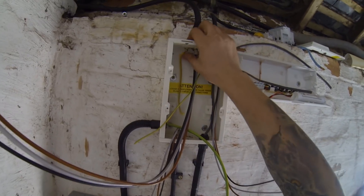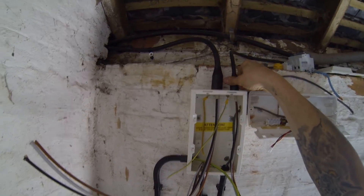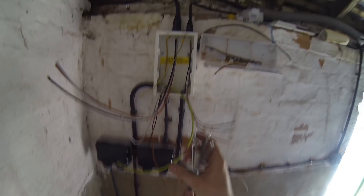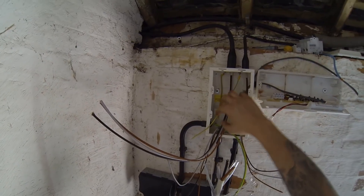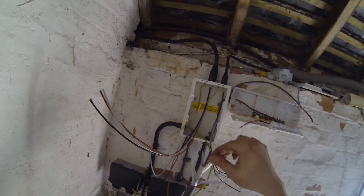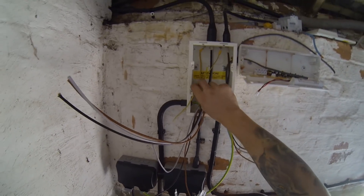I'll explain this to anyone that's not an electrician watching. These are called banjos, and they sit under your locking nut that is connected to your glanding kit at the top. Your armoured cable has your multi-core cables inside with another plastic sheath, then your metal armour spirals around the outside for added protection. The banjo, when you put this into the earth bar, earths that metal outer casing. So if anyone goes through the cable with a spade, instead of hitting the live terminal and getting a shock, it would go through the earth first - it would trip at the board. That is the reason for these earth fly-leads coming off the glanding kit, to earth the outside of the armour cable.